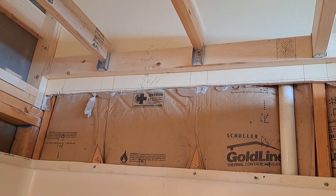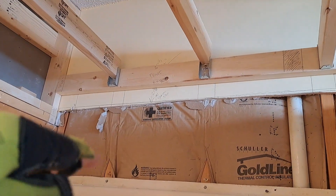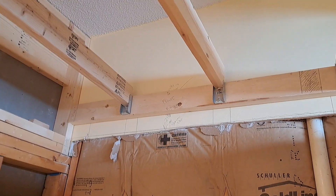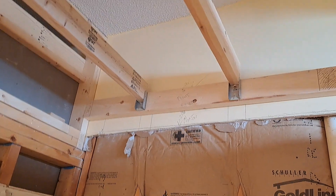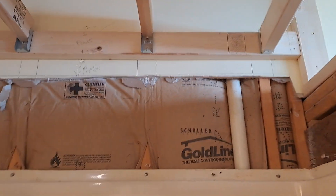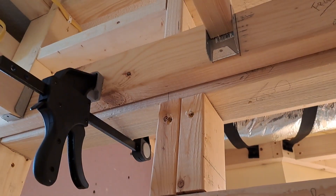Here's what I've been working on for the last hour or so — my braces. Nothing's installed yet because I have to get the right height for the showerhead. But I like how it's taking shape. I'm going to be going into studs along this back wall, and I've got some nice good meat on this side, so everything is looking good.